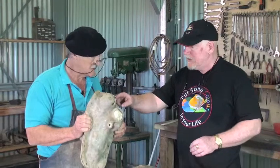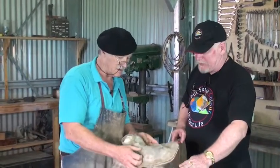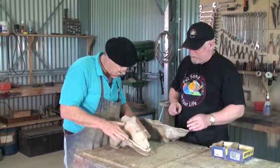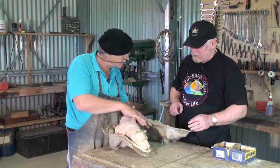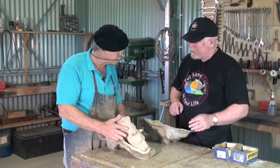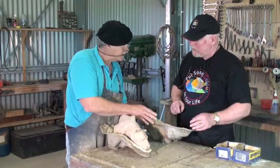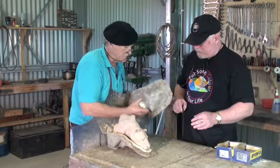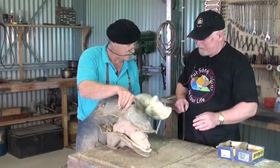To get this silicon here, you've actually got to cover that with clay, haven't you? Correct. You cover it half with clay, exactly to the cut line. On top, you put a 6 mil layer of clay, and on top of the clay, you put a fiberglass jacket. You do it on both sides.